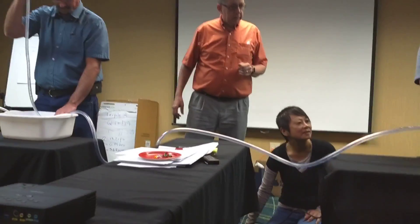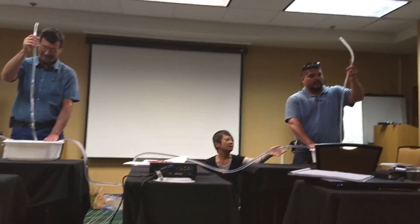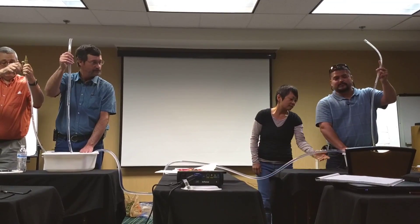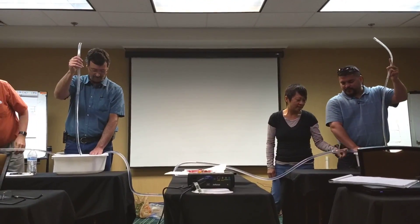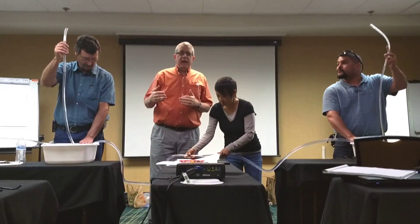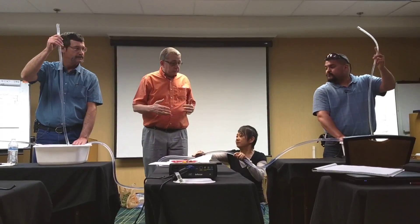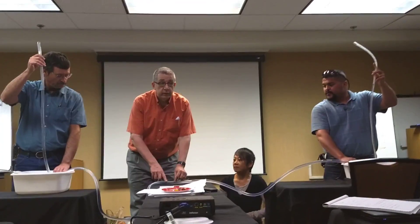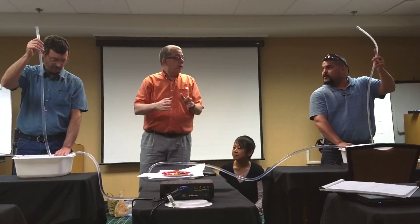Alright, so let's see that. It's going to take a minute or three to fill up this pipe. So we were having a short discussion on hydraulic grade line. The hydraulic grade line is the combination of pressure head and elevation head, and it does not include velocity head. Anywhere - if this is say two feet where Jeremy is, what's the pressure in the pipe right here? One psi, right? It's going to be two feet everywhere because the pressure is completely the same.